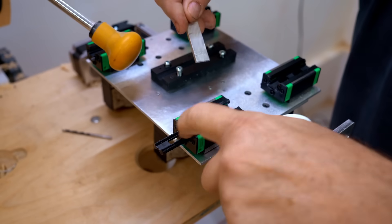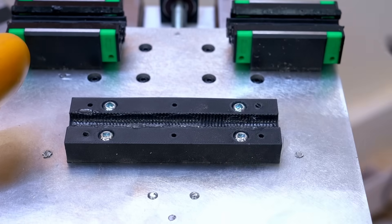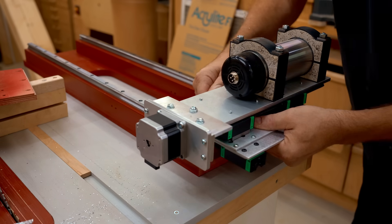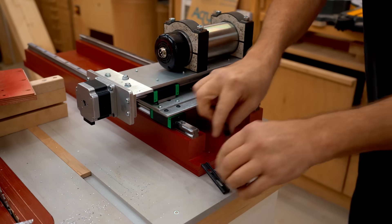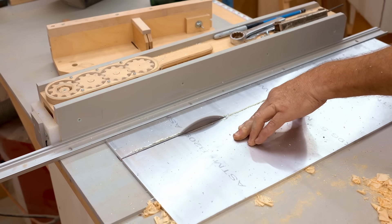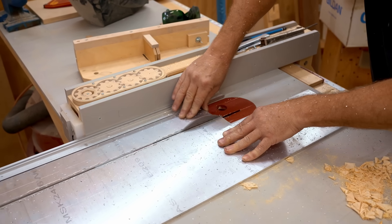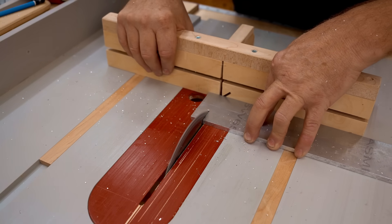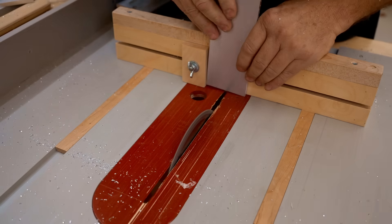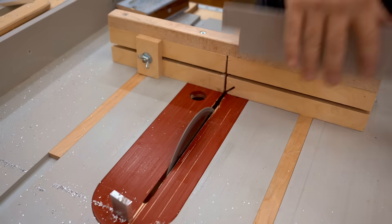While the paint is drying I get some real grease into the linear bearings and also into the lead screw nut for the x-axis. When the paint was dry I took off the masking tape and got the x-axis put back on. The gantry is made from plywood and solid wood — pretty stiff and strong — but I can increase the stiffness quite a bit by adding some metal. I've got another piece of aluminum that I'm cutting to the correct width to make two plates that will mount on the top and bottom of the gantry. I'm making the cuts on the table saw with a metal cutting blade, being very careful. After the cut to width I cut them to length using my mini table saw sled, and one of these needs to be notched on the end to fit around the gantry sides.